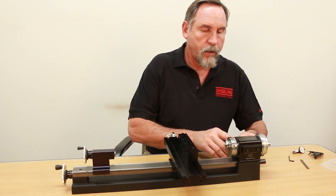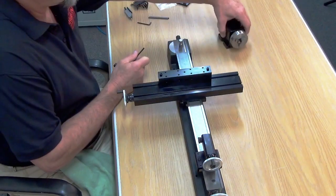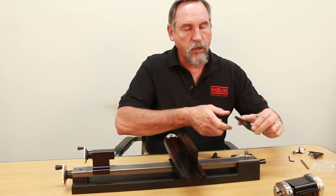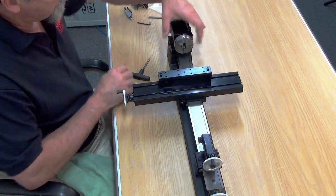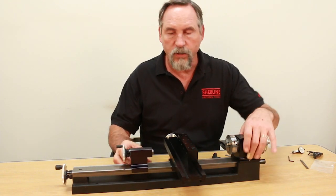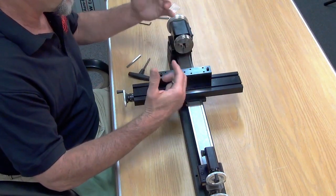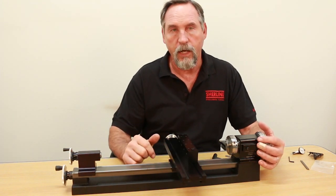For start, you take off your headstock. What you get with your spacer block is a different pivot pin, the spacer block itself, and another headstock key. This spacer block, when you put it on here, is set so that your headstock height is on center line with your tool post. It's important to note that once you have this on here, your headstock is no longer the same height as your tailstock, so you cannot do tailstock jobs with this. It's set up primarily and specifically to use your lathe as a chucker lathe, a multi-tool gang tooling lathe.